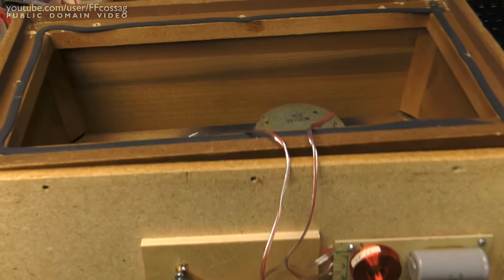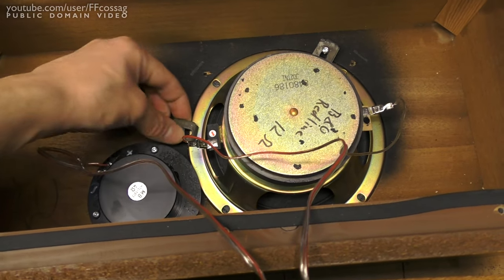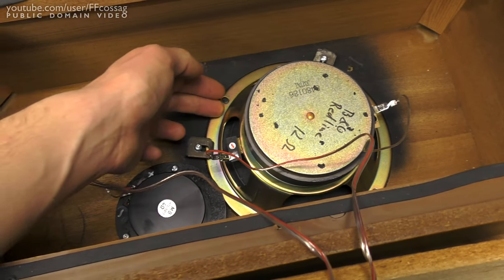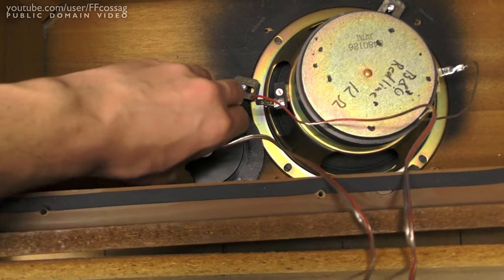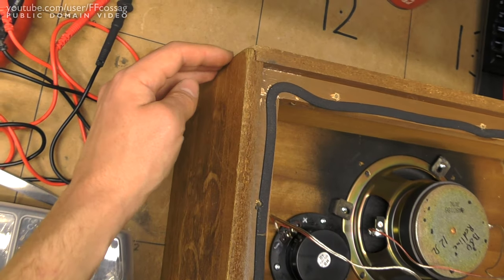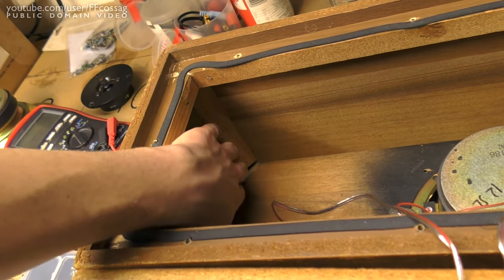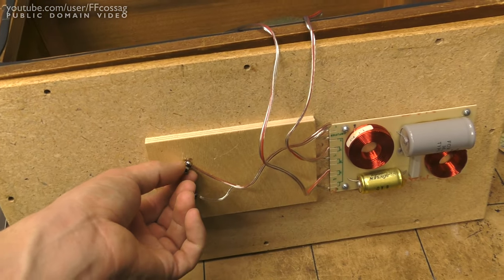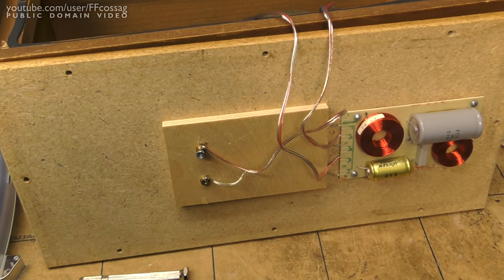Here's a final look inside prior to putting all the stuffing in. I have modified the speaker for a three-screw mount — these are a sturdier replacement with some more modern self-tapping screws. We have this very nice thick foam surround on the woofer as well. Something I am concerned about is that this cabinet is cracking along the seams on the outside, so I'm thinking I'll just splatter some glue all over. We also have this one broken contact here — it's not sitting very well in the wood, so I'm going to put wood glue around that and have it dry over time.